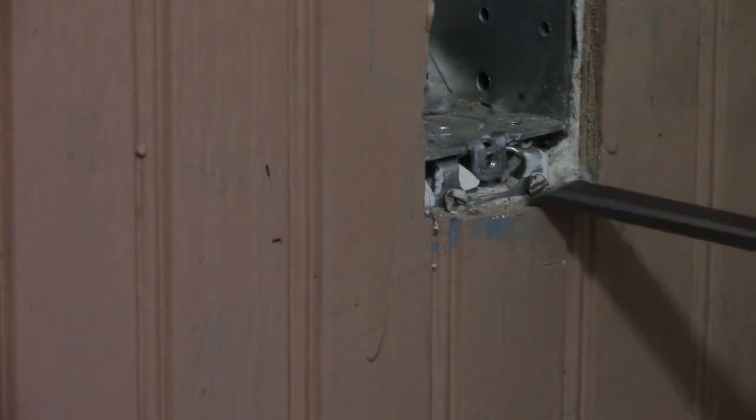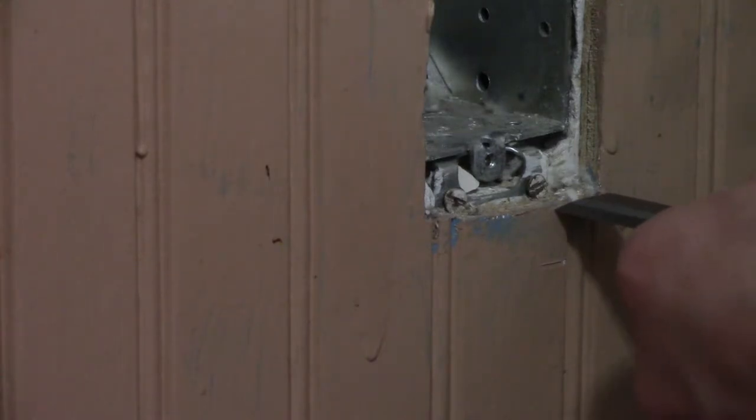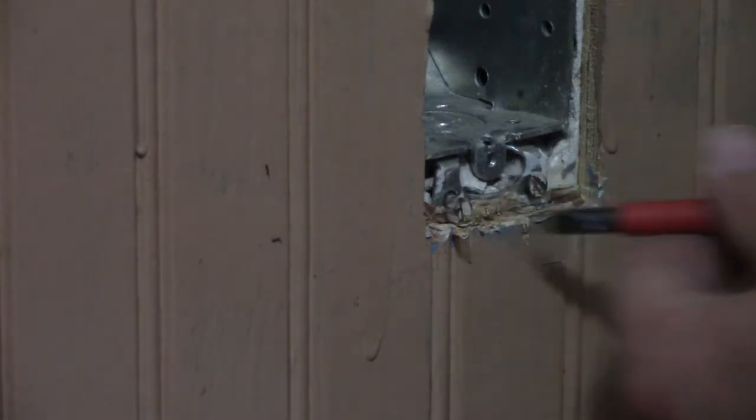What I'm going to do — there are two screws down here and a metal plate underneath that's a little lower than the wall material. I'm going to chisel this a little lower and it should be covered by the faceplate once I put it back on — that covers down about three-eighths of an inch or so. I'm going to take off about an eighth of an inch — going to chisel this out. Alright, that may do it; it seems to be wiggling a little easier.